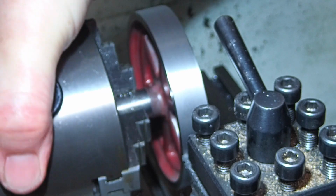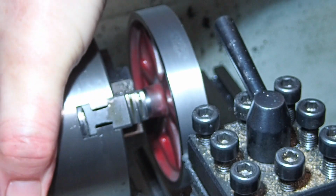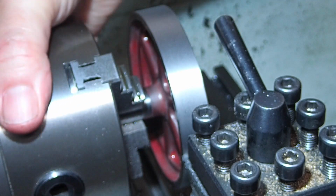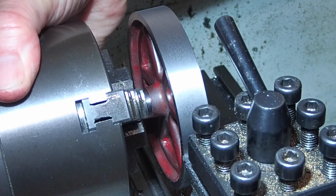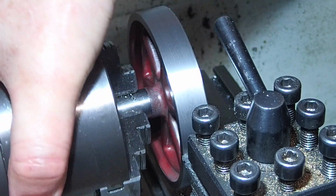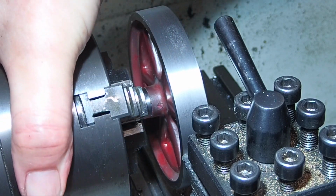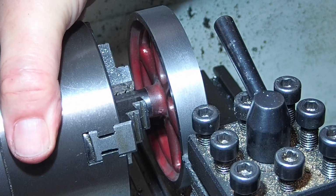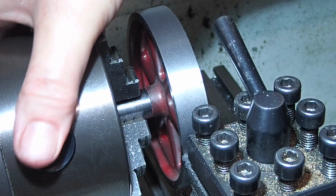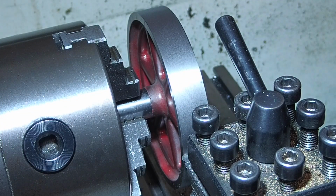Yeah, that's looking good now. It's taken a thin skim all the way across the rim of the flywheel and there's no sign of any of the etched lines now. And just for those who thought it was a crack, definitely no sign of a crack. Most definitely was not cracked. Anyway, happy with that. So now we'll move on to sorting out the sides of the rim.